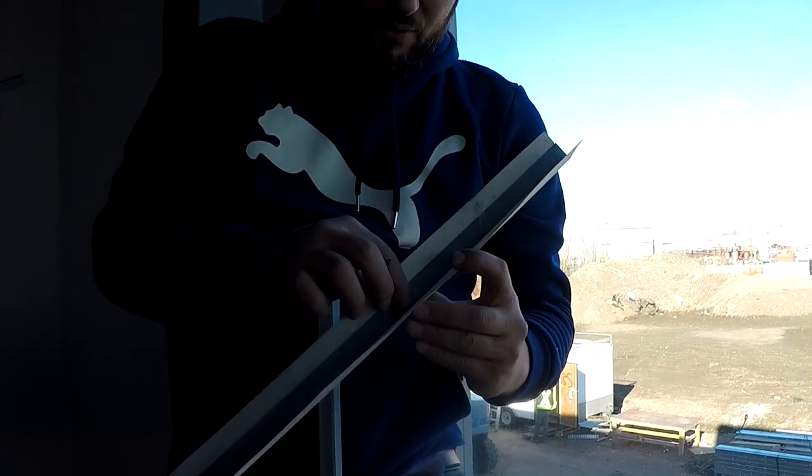The tear away finishes into the mullion, giving the mud a straight finish plus a hard plastic edge for extra strength — same with the corner bead. I like a quarter-inch reveal on my corners and a quarter inch on the mullion for the tear away. Three-eighths is acceptable; half inch is too much.